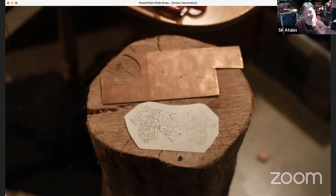And I realized, yeah, if I just ventilate my area, I can just burn this stuff off and get rid of it. Also, it re-anneals the metal, making it soft again, because working with those chasing lines, I've work hardened it a little bit. I may as well just use that, because I don't think that piece was annealed in the first place. A lot of sheet metal comes to you already on the soft side, but when you have something annealed, you can really tell that, oh wow, this is really soft now.